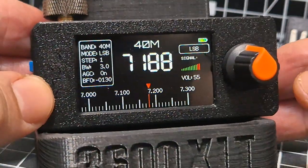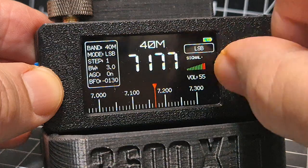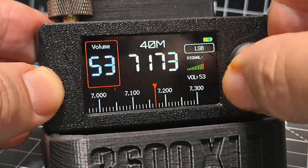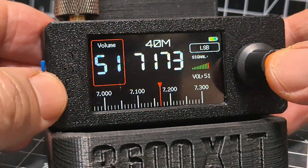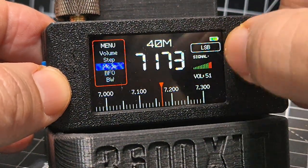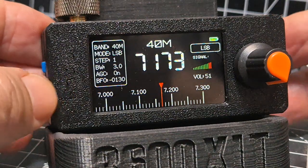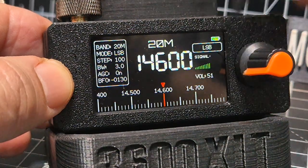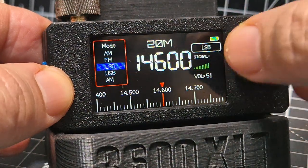Double-click to go to volume, press, and lower the volume — clearly marked here. It's quite loud for a small speaker, but with an external speaker it actually sounds really good. Let's try 20 meters — press it once, go down to 20 meters, press. We need upper sideband, so two presses, go to mode, press, and upper sideband.